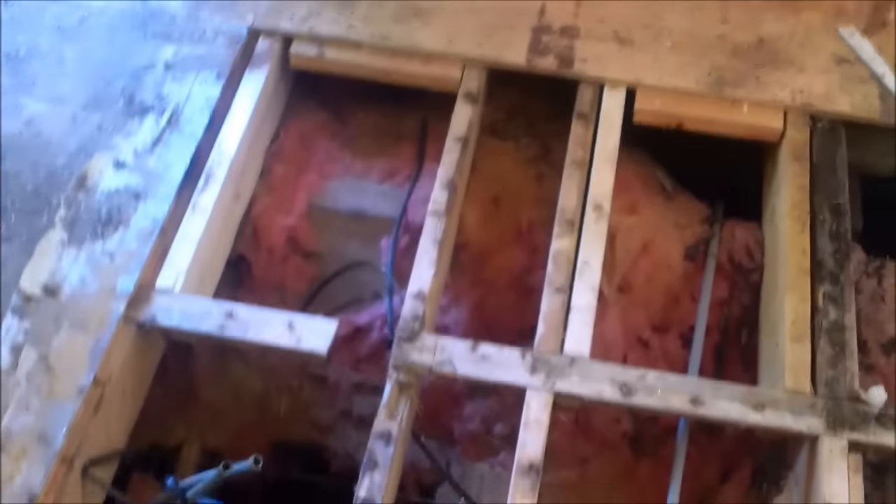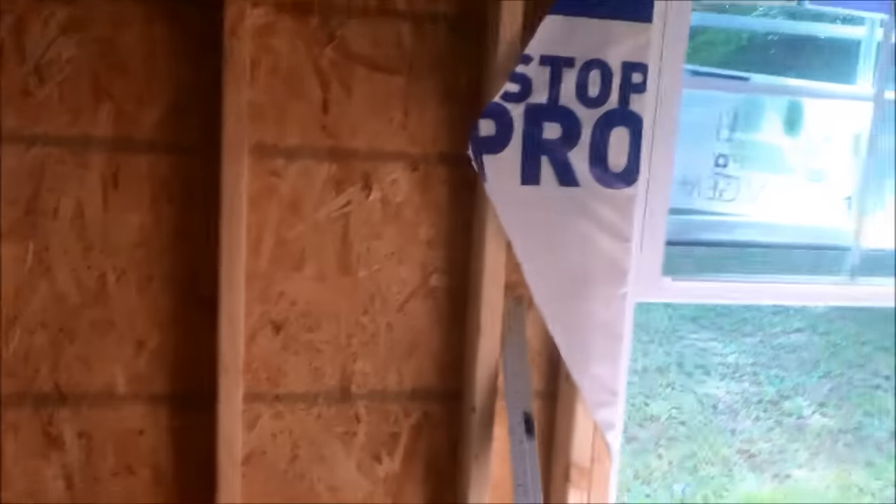This is going to be two bedrooms — about 22 feet of room right now — and part of me says why not make this one giant bedroom with his-and-hers closets and a bed in the middle. The old subfloor has all the cuts for the pipes so it's kind of rotten. I've removed that segment of floor and I'm going to put new material in, but I'll leave one section open because I gotta patch the air duct — there were too many vents. I put little pieces of 2x4 scrap screwed to the lip of the plywood so it has something to rest on with no sag. The insulation is like a crushed newspaper lint material — it really irritates the lungs, so I wear a mask when I take that down.